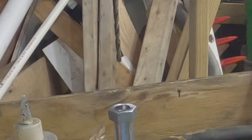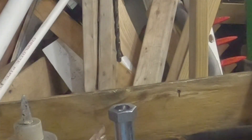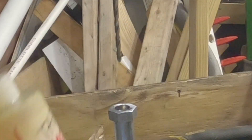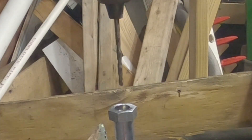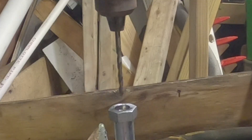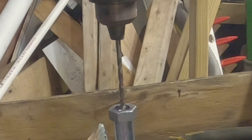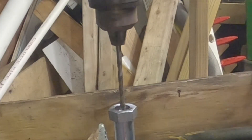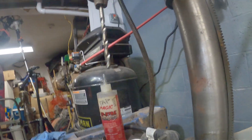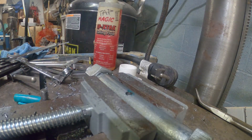Let's get back to it — this should go a bit faster. So you guys can see that I drilled out and chamfered the head of the bolt, and now I'm going through with the pilot hole in order to go as far as I can for the grease channel. I went through a couple of iterations of this as well — I didn't think I went far enough down to meet the long channel, but eventually I got there and that's what you guys are seeing.